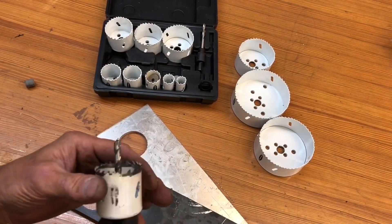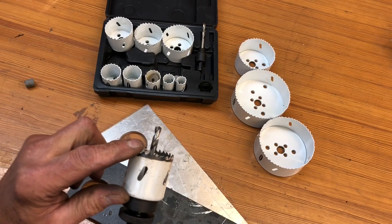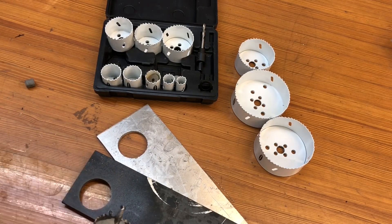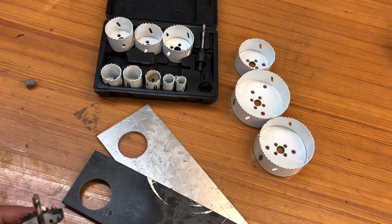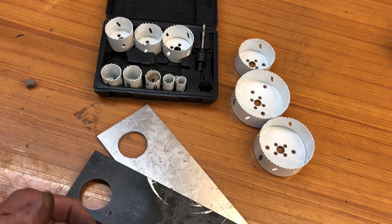Here's a quick summary on the two-inch bi-metal hole saw from Harbor Freight. I purchased this whole set for under $50 on sale because I was curious about its quality. I sawed through quarter inch stainless steel, quarter inch aluminum, and quarter inch hot rolled steel. It didn't lose any of its teeth on the saw blade. It sawed true and within 20 thousandths of size. I would say it's great for the hobbyist — maybe in the bottom drawer of the old toolbox. I wouldn't probably buy it for a high production setup, but for the hobbyist I think it was well worth the 50 bucks. Thanks for watching everybody.